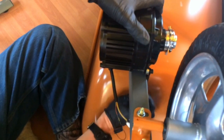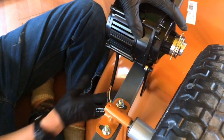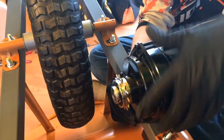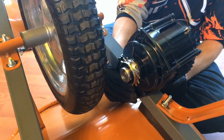When you line it up on the wheelbarrow you'll also notice that it hits against the wheelbarrow too, which is really nice — you want something to stop that counter-rotating force when the wheelbarrow is pulling. We're going to drill two bolts through here, and you can see the amount of spacing we've got. We need spacing for the gear and for the chain tensioner. Right about here is right — we're going to put in two bolts and bolt this plate right to it, then start working on the front wheel.